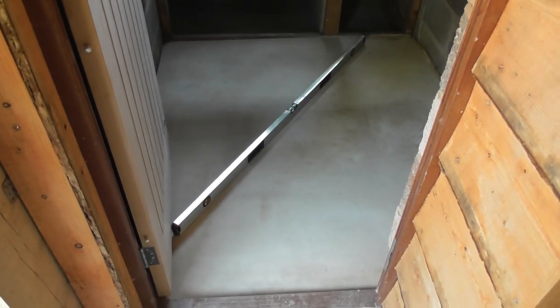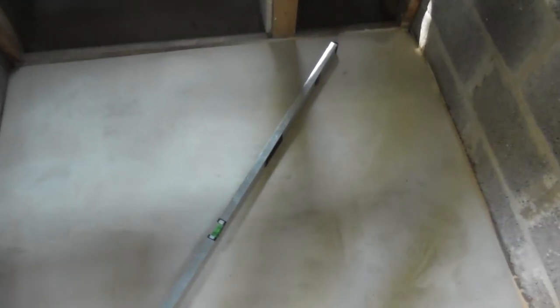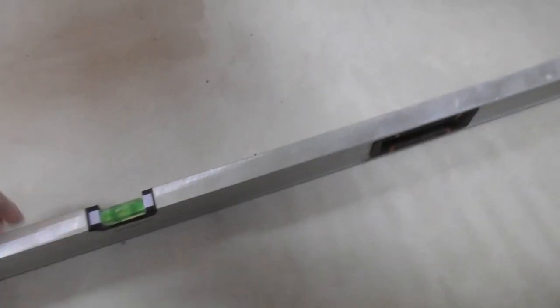It's the following day now, the morning — it's been down for probably about 16 hours. You can see it's fully cured and set. There we have the finished floor. Just to show you, I've grabbed the spirit level — you can see the bubble is right in the centre. If I put it lengthways, the floor is flat, and there's no gap underneath the level. Hopefully that gives you a little insight into how to lay a screed floor. Sorry it's only a small job, but you can see the mixing process, how to lay it out, and what the finished results will give you. Thanks for watching, speak to you soon.